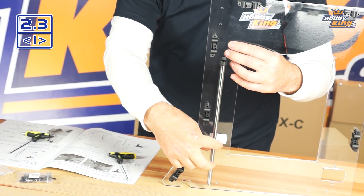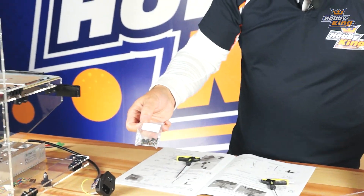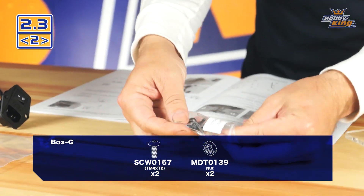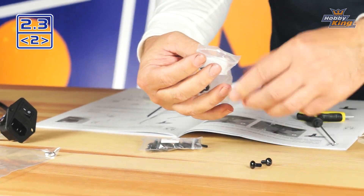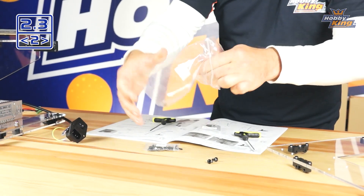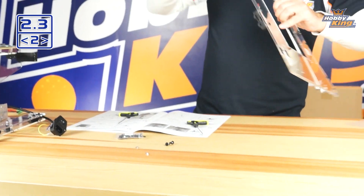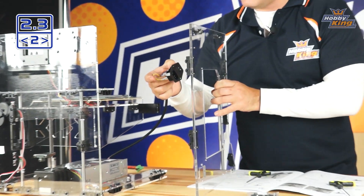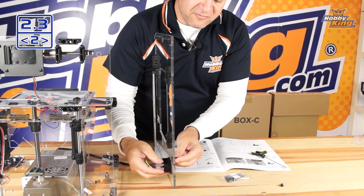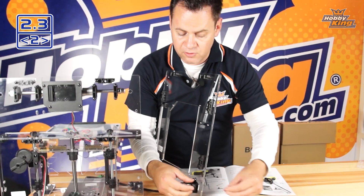The rod should still be a little loose — that's what we're looking for. Next is the power receptacle, and what we need is 2 of our M3 157 machine screws and the 139 nuts. This is where the 2.5mm hex driver comes in. Take the panel and get it close to the receptacle extension, hold it up, and the screw comes in from the outside towards the inside, then take a nut and thread it onto the backside.